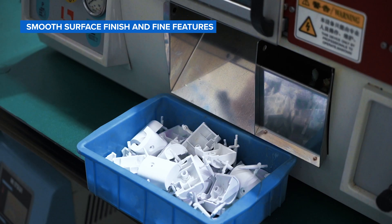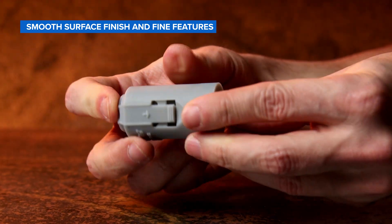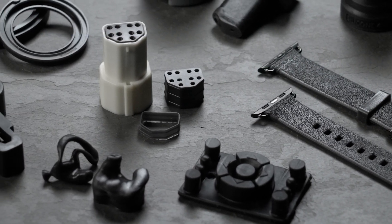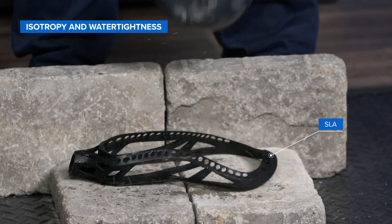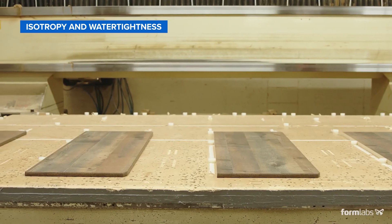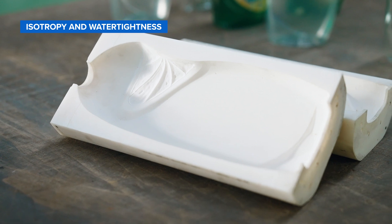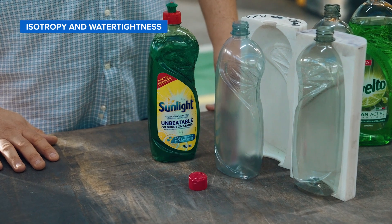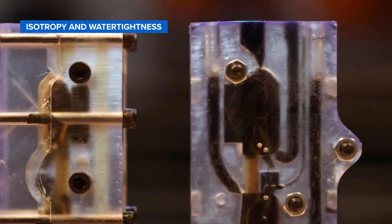It also makes secondary processes like rapid tooling possible. As the light and resin in 3D printers can be controlled so precisely, SLA 3D printers can achieve finer features and smaller minimum feature sizes than FDM 3D printers, comparable to that of SLS 3D printers. Because 3D printing creates parts one layer at a time, prints may have variations in strength based on the orientation of the part with some printing processes. In contrast, SLA 3D printers create highly isotropic parts, resulting in parts with predictable mechanical performance critical for applications like jigs and fixtures, in-use parts, and functional prototyping. SLA printed parts are also continuous, whether producing geometries with solid features or internal channels, and this water and air tightness is important for engineering and manufacturing applications where air or fluid flow must be controlled and predictable.